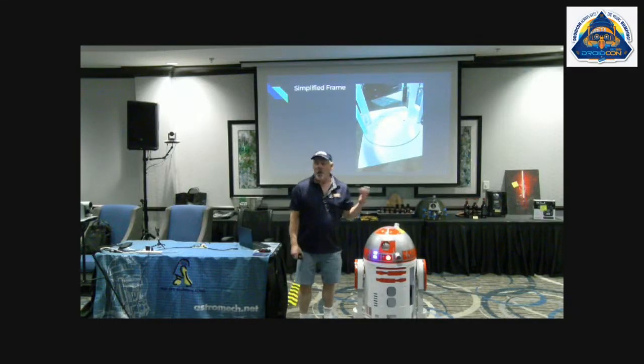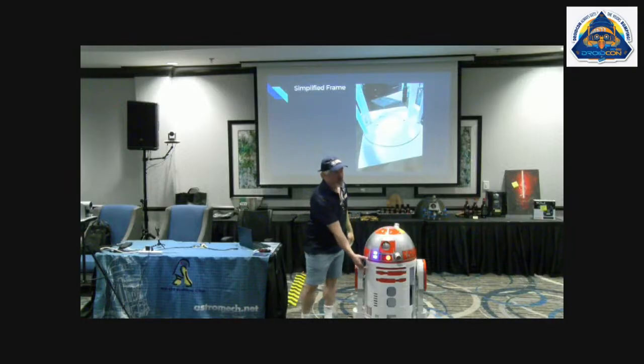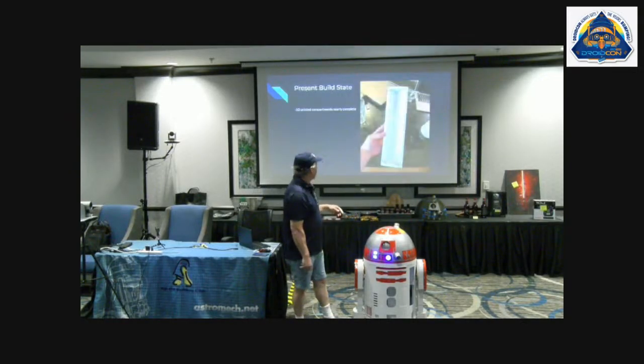I could make a frame that's basically just shoulder mounts and verticals. That's it. Because the 232 system handles most of the structural element between the center foot and the shoulders. So all it's doing is supporting the skins and any plastic greeblies that are on the outside. Speakers, I guess it's got the speakers in there, but they're only a few pounds a piece. So it's not supporting anything at all.